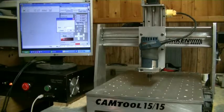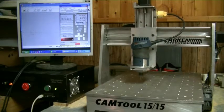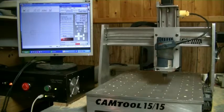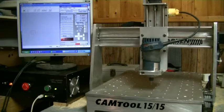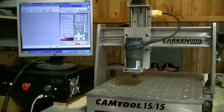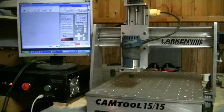Let's say that's the top of the work. Now in the middle here there's a slow, a fast, and a one-step mode. Go slow and you can jog down really slowly — here's the feed rate it's doing in the corner. We're going to go down, let's say that's the top of the work. We'll go Set Z — Set Z Position to Zero. See it says minus 2.99 when I click Set Z Position — it goes to zero. All you have to do now is raise the router up and go Run, and it's cutting.